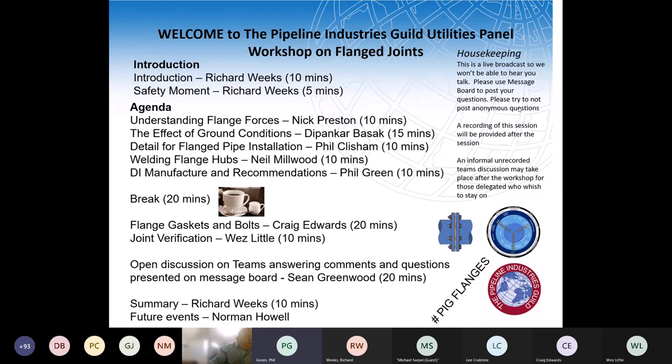So it's basically a shot blast or fine linish, which is a fine grinding process. And after we've done that, that's the point at which we take the dimensional detail for the outside of the pipe so that we then machine the bore of the flange to suit that linished surface. No problem.